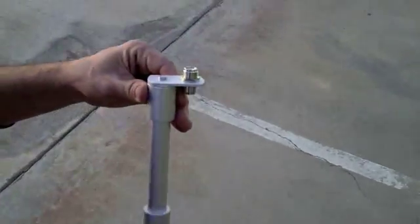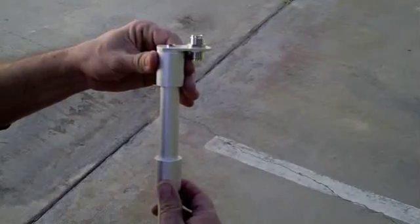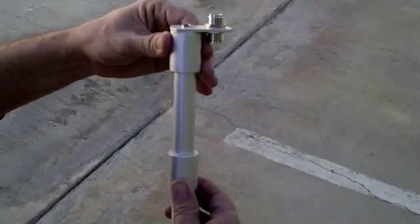Here is the CP-45 lightweight telescoping mast. A double female UHF connector is included so a mobile antenna can be attached if necessary. Spacers increase the diameter of the upper section so you can attach the standard base antenna and brackets that come with most antennas. Friction locks hold it securely when extended.